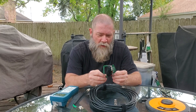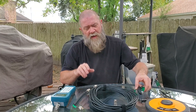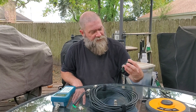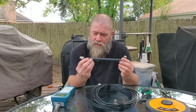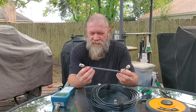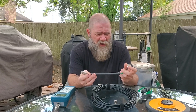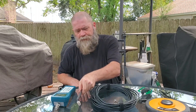You guys were asking about a follow-up on this video and how it works. So today we're going to measure it out, get it up on a pole. I'll use the Rig Expert to figure out the SWR. I'm going to try two different things: first, get you guys some exact measurements for the bands I'm going to use this for. And I'm also going to try it using the coax by itself with this ABR choke. I got this from ABR Industries at the Belt and Ham Fest — they ran about $30 at the festival. You can go to abrind.com to check if you can find this choke on their site. I know they carry them as a regular item and they work really well. We're going to look at the SWR with the choke at the antenna end and at the radio end and see what kind of differences we get.